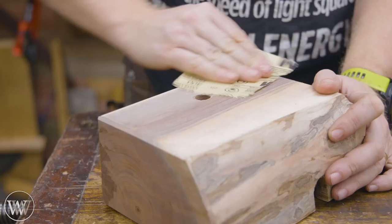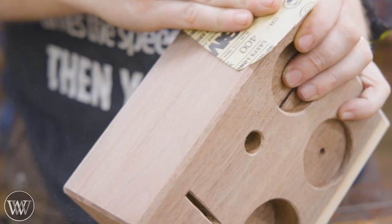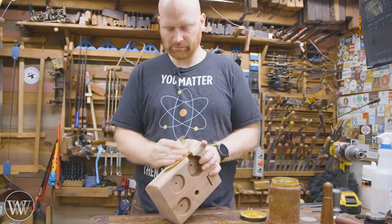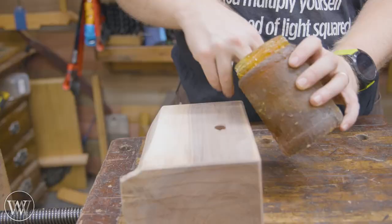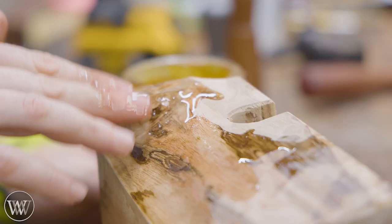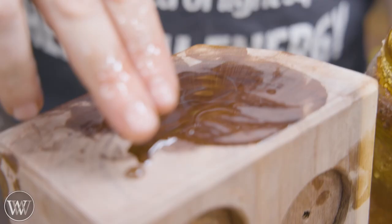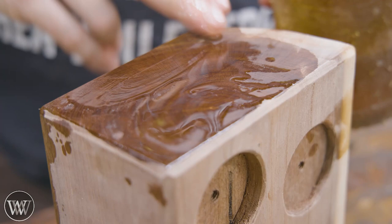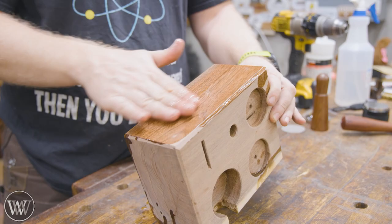I am going to sand this after I've smoothed it all — just hitting it with some 400-grit sandpaper. This will actually fill the pores with dust, which allows the oil to soak in a little bit farther so you get more of the richness to come out. Especially in this walnut, I want that deep, rich color to be separated from the front white of the sapwood — I kind of like that contrast. Walnut is a beautiful wood with its own contrast between the sapwood and the dark chocolate inside. I love this part, especially with the walnut — it just soaks it up. This wood is so dry you can see it running right into the end grain. I ended up putting six or seven coats of boiled linseed oil, soaking it again and again until it stopped taking more. I'm going to let it soak in about 15 minutes, then wipe off the excess and apply paste wax.